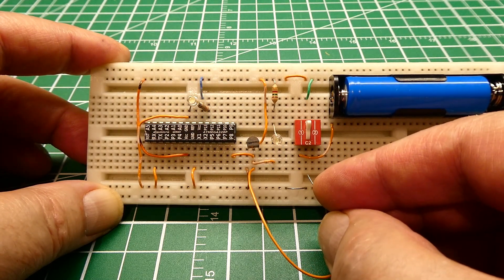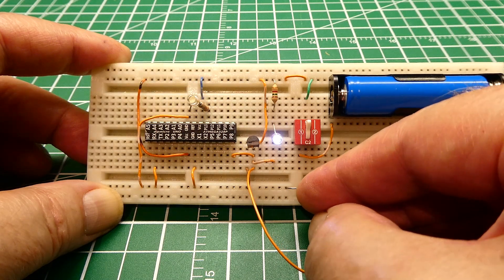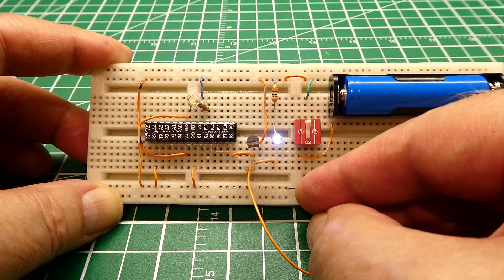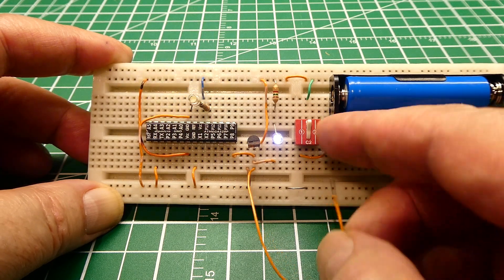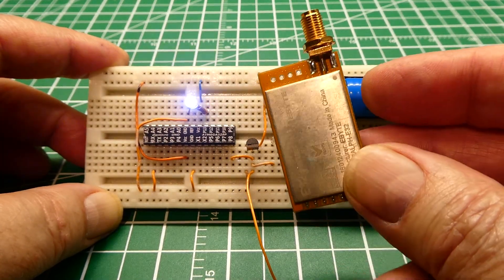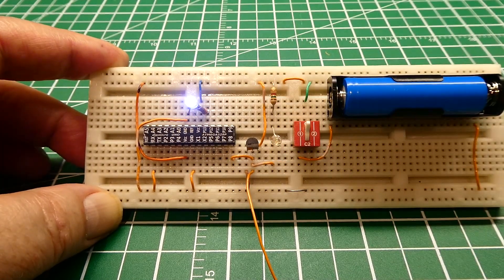When I remove the wire, it goes back to a slow flash. The input into the microcontroller could be an interrupt, or you could poll it, and you could set off a beeper, shut down the system, or if you have a radio, you could send out a message saying 'my battery is low, come and change me.' So that's my tip of the day — how to build a simple low battery alarm using a 3.3 volt econo reset chip.